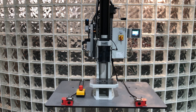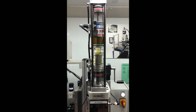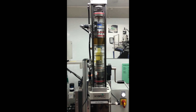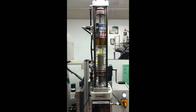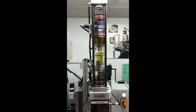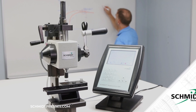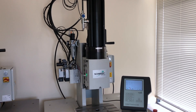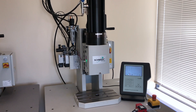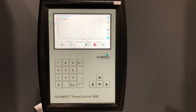When even higher force or smooth hydraulic action is required, the Schmidt hydro-pneumatic press line is the perfect choice. Our hydro-pneumatic presses use a combination of air for fast approach and retract speeds and transfer to higher hydraulic force to complete the operation without the mess, noise, or heat associated with a slower hydraulic system. Like the Schmidt 300 series manual press, direct acting air and hydro-pneumatic presses are also available with our integrated force and distance sensor technology and supplied with our enhanced control systems, which provide full force and distance feedback and can be monitored to eliminate the costs associated with post-process part inspection.